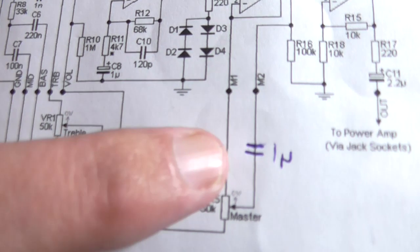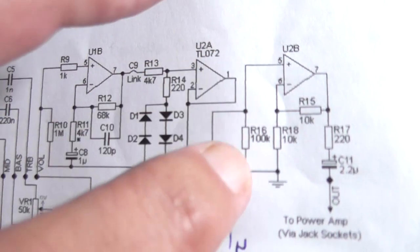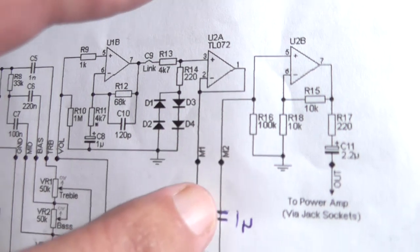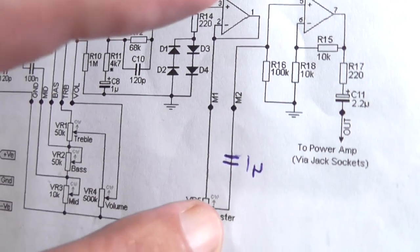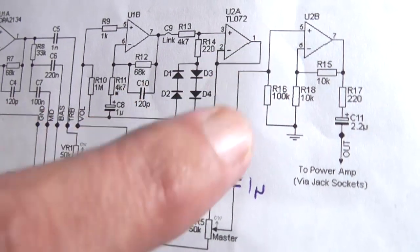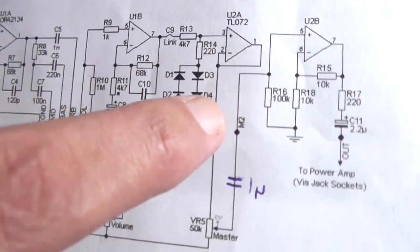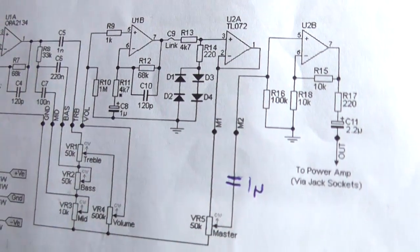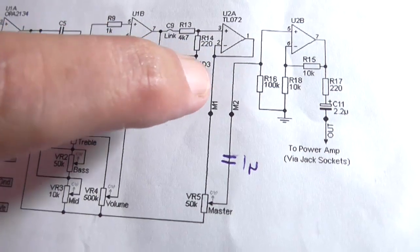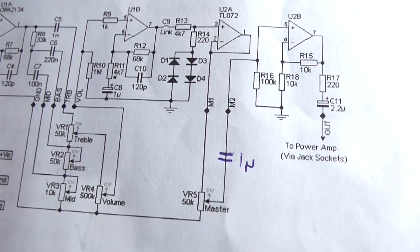of the pot here, the clockwise position, the operation was exactly the same, where it would be either full off or full on. That may be that resistor is affecting the pot because it's directly connected to its input pin, so we're causing an unusual load on the pot, and by rights, really, you should have a capacitor isolating the pot from the input of an amplifier stage, same as there should really be a capacitor here on the clockwise position isolating the output stage of that one before the pot. Technically speaking, it also keeps DC out of the pot, because over time the small DC offset output voltage that's present on all op amps is going to eventually make this control sound rather dirty, scratchy.